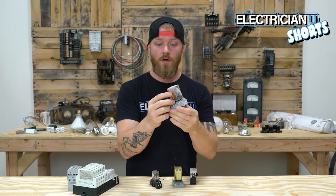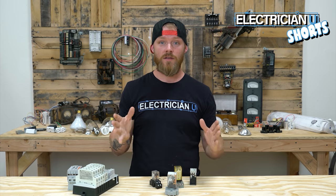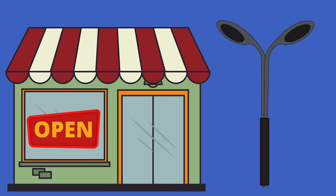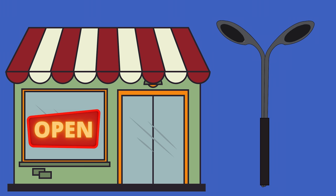What's cool about a relay is this ice cube relay comes with multiple normally open and multiple normally closed configurations. Say you wanted a certain set of lights to turn on and a certain set to turn off at the exact same time. You could set up a couple of these to be on the normally closed setting while you have a few on the normally open setting. So when this thing energizes and changes states, it changes the states for everything — anything wired normally closed, meaning normally on all the time, and anything normally open, which is normally off, it's going to change the states of both.